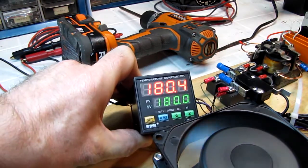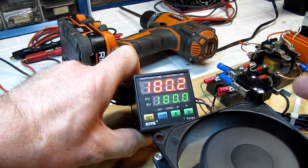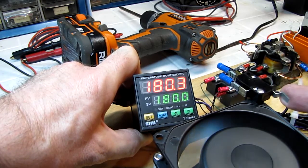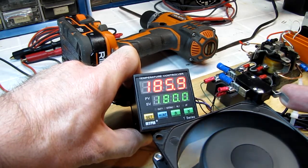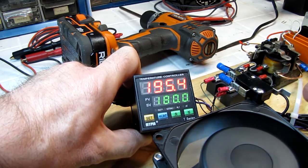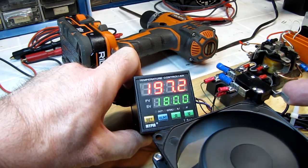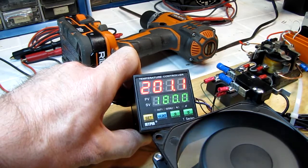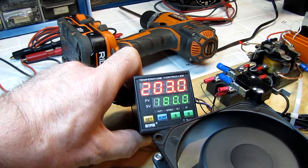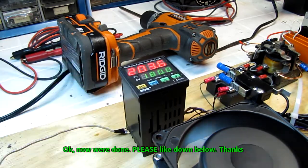For those who stuck around: I want to show you how quickly I can bring this up to soldering temperature. I just push my little turbo switch and you can see how quickly the temperature comes up. It doesn't take long — 195, 196 — that's plenty hot enough to start soldering. I could give it another shot to put it at 200°C, do two, three, or four joints, and then go back and prep more cables while the temperature falls back down to the maintenance point. See ya.